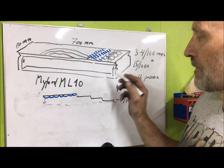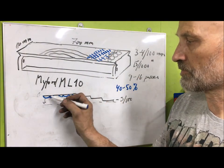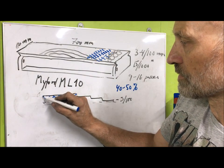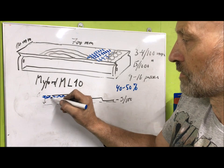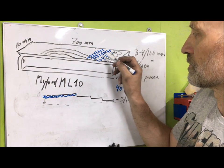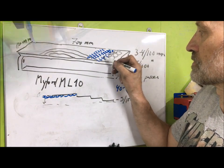And you fill out. And then of course, getting into the final stages, as we learned, you shall try to keep the depth, and then you will gradually cut finer and finer and finer, to the point that you will get, of course, these individual points.